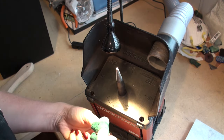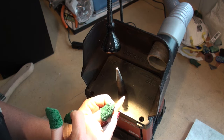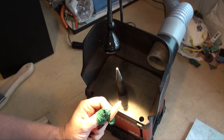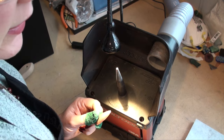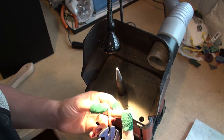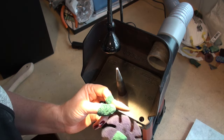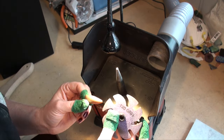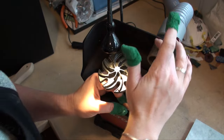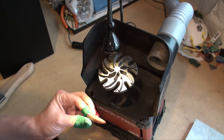So what I'm going to do is I've done a rough cut around this, but now I just need to smooth this down a little bit, remove a little bit more material so it fits my shape a little better. I can go with a fairly gritty disc depending on how much metal I need to remove. In this case, I don't really need to remove that much, so I'm going to go with a 120 grit disc — this is a ceramic one. I also have a vacuum hooked up to this and a light so that I can easily see what I'm doing.